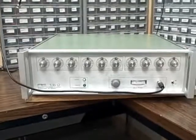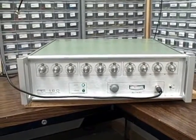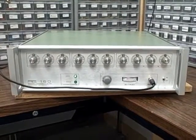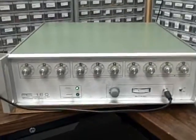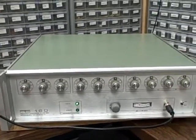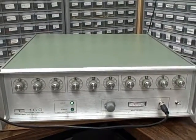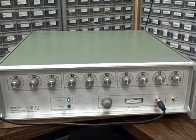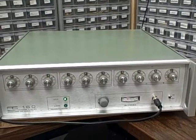When I got the unit it wasn't functioning, and it was written up that way. But it didn't take me very long to realize that the reason the unit wasn't functioning was that it was missing an internal oscillator. So I've added an internal oscillator — a 10 megahertz OCXO. It's made by Morion; I think it's an MV102A and we'll double check that.